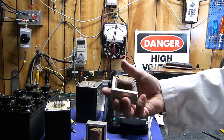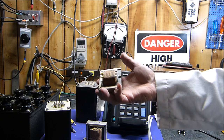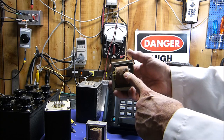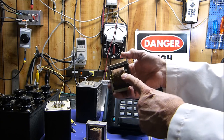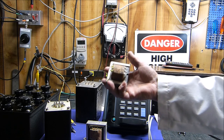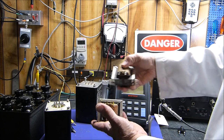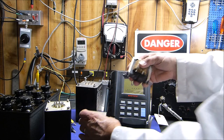Well, I have some old Collins radio equipment made back in 1947. Now, I don't know the date that these were built, but they could be that old. And if you run across transformers and chokes that have an M on them, M means K, means 1,000. It's the Roman numeral M. You know, like the year 2000 was MM. So if you run across this stuff and you see M on it, you know it's vintage. And it actually may be very good quality. These measure out very nicely on this device right here. Those would be some really dandy transformers.